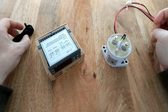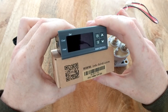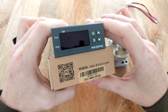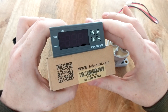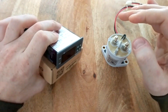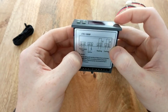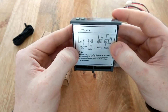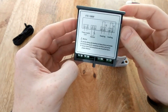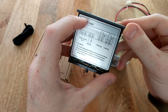I'm going to be using a couple of components. The first one is a digital thermostat — these are available online on eBay or Amazon. The model I'm using is the Inkbird ITC-1000, specifically the ITC-1000F, which is the 12-volt model. The F stands for Fahrenheit. The device can be programmed in either Celsius or Fahrenheit. If you purchase just the standard ITC-1000, it is only Celsius, so if you're in the United States and want to display temperature in Fahrenheit, make sure you buy the 1000F.